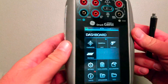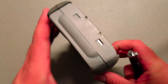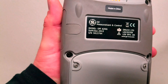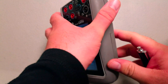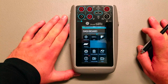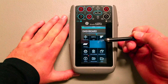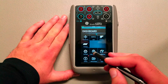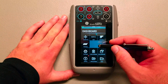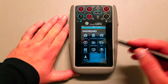All the buttons are encased and it has a nice front end. These are the gold ports here for connecting to the pressure base, which we'll show later. On the front end here are your applications for operations: calibrator, HART communicator, FieldBus, and PROFIBUS. This unit does not have the FieldBus and PROFIBUS, but they can be downloaded and added later — this unit just doesn't happen to have them.